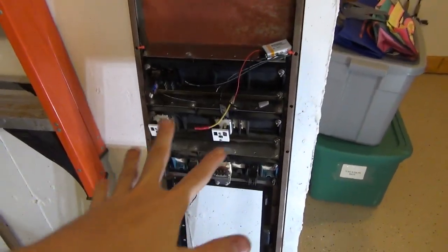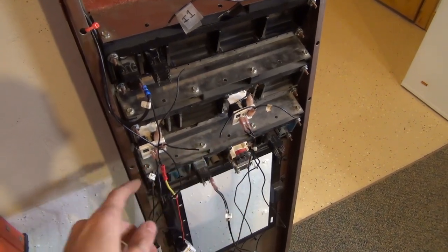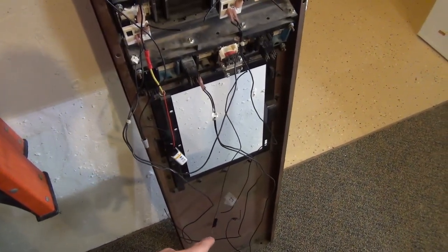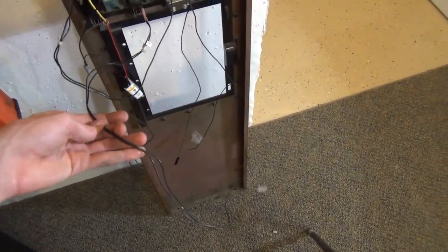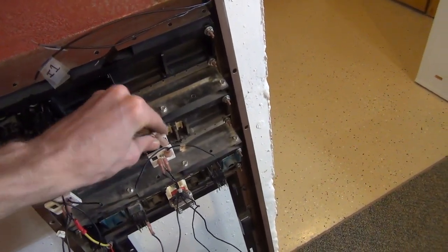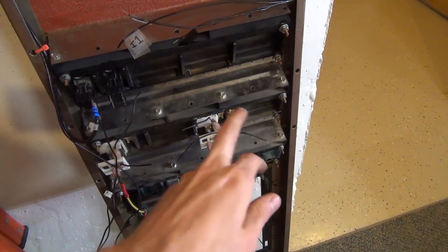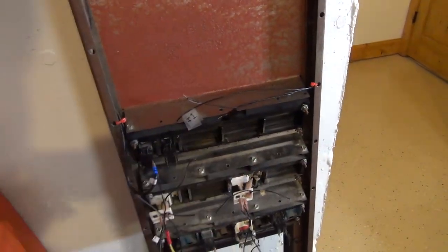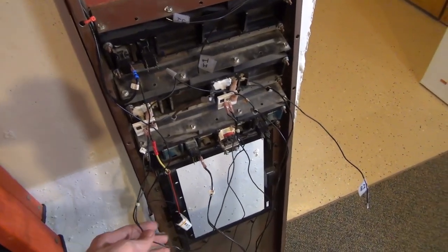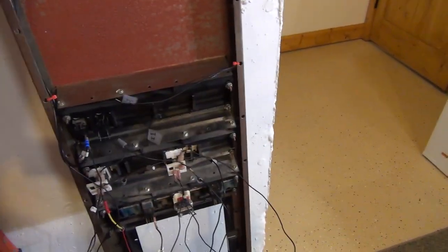All nice and tidied on the side — we've got our indicator wires on the right side, our three connectors, and the light switch. Next step, we need to start working on the lower half of the panel. We've got our LED parts hooked up with the bulbs in — L1 and L2, meaning light one and light two, plus the common ground. We've got our alarm button hooked up with common ground and AL for alarm. The buttons have little pins and we're hooking those together for a common ground, with B1 and B2 going up to the Arduino. Wiring is complete for all the buttons and lights.